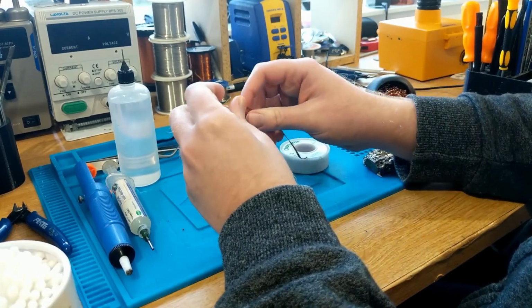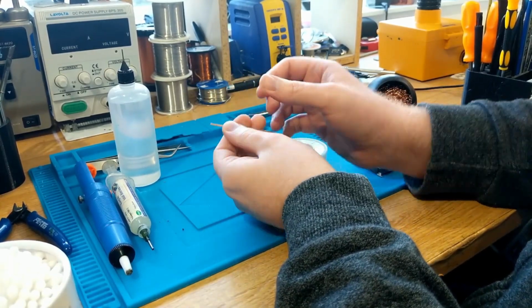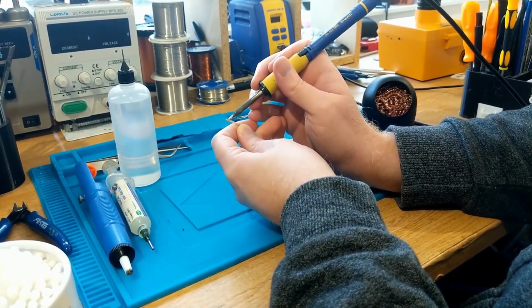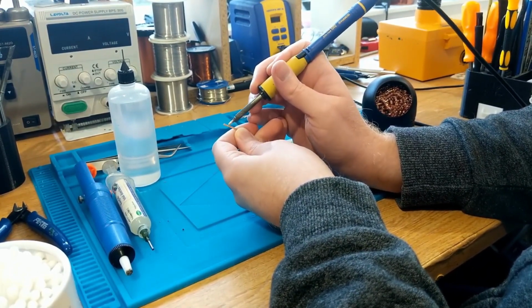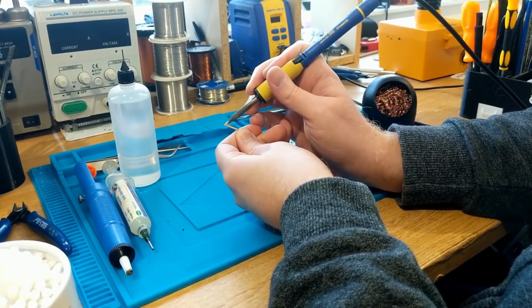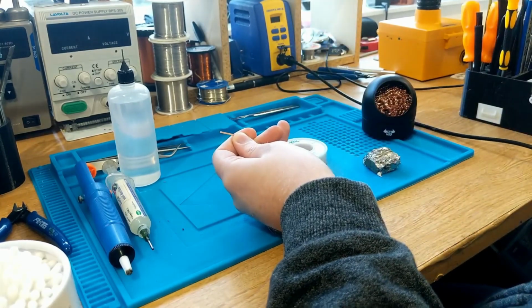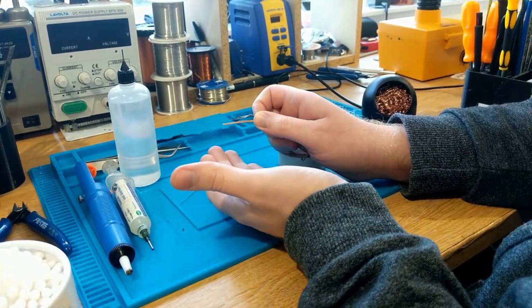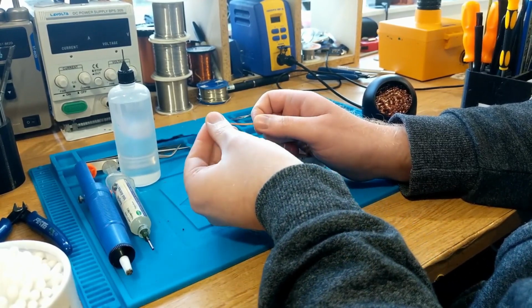And what will happen is you place this on top of your solder joint, you come in with your soldering iron on top with a good bit of heat, and that heat will then heat up the desoldering wick and transfer into the solder and the joint using capillary action. The general gist is it will soak up like a sponge any solder and draw it into the wick.